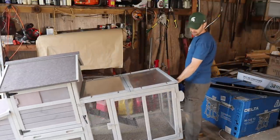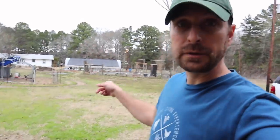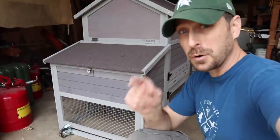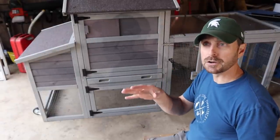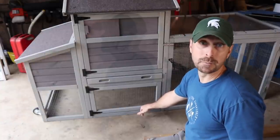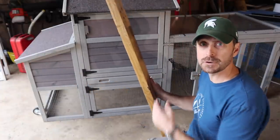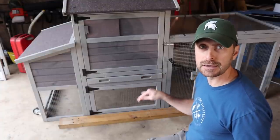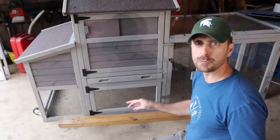It's really easy to pick up and move around on a hard surface with no issues. However, the wheels on it are way too small — even though they work really well on a hard surface and it rolls easily, it's not going to work well trying to drag it through grass. Also a big issue in terms of materiality is the bottom rail. In my climate, where it's going to sit on the ground, these small pieces of white pine aren't going to last but a few months. We've got termites here and a really wet spring, so it's going to rot out super fast. I'm going to take some treated lumber — a treated 2x4 — and screw it to the bottom of the entire thing to keep the termites away and prevent those small bottom pieces from rotting out quickly.